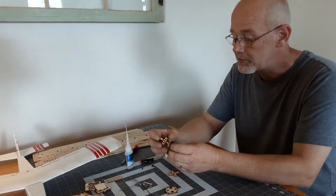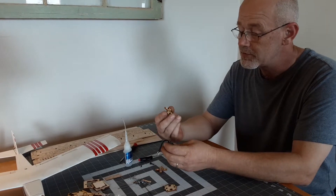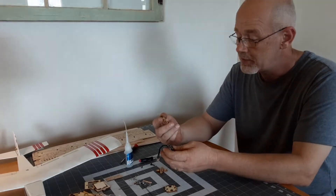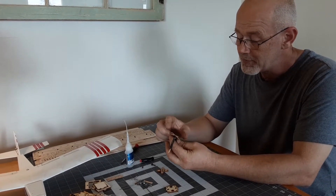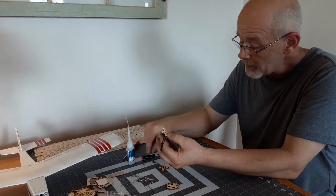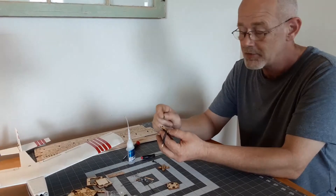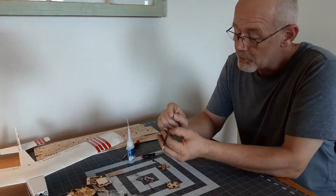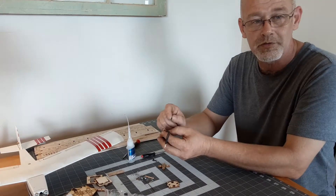The first thing that you need to do is punch out the parts that come in a laser cut piece of plywood, and then you're ready to go. Since this is an offset pattern, we're going to use motor mount M1 and M2. You'll notice M1 has a smaller hole diameter to match up to the motor itself and to accept the screws. Go ahead and line that up with the back of the motor. Most of the motors come with mounting screws. You'll want to select the shortest possible screw that will mount the plate to it. If you use too long of a screw, you run a risk of running it through the back of the motor and contacting the motor windings, and that will ruin your motor. So make sure you use the shortest screws that you can find.